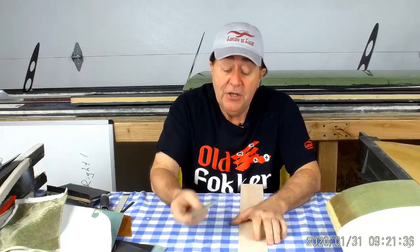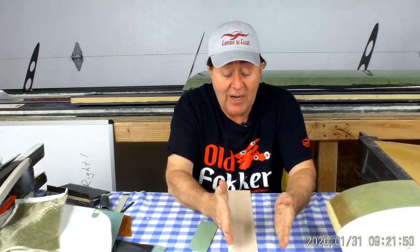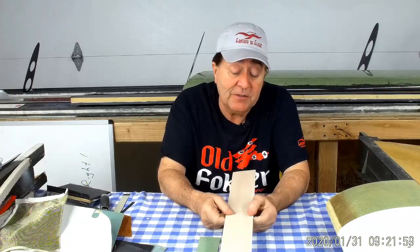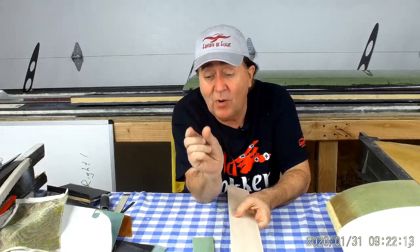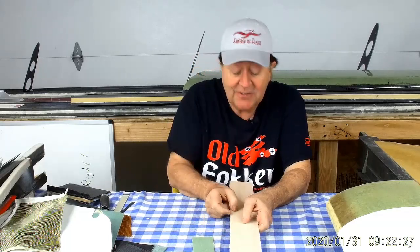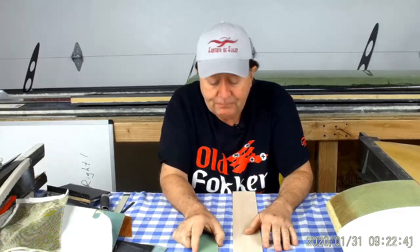So I don't have to worry about pre-gluing and getting a rough, crooked joint. I can just cut strips of balsa about an inch to an inch and a half wide — it's flexible enough to go around the mold at that point since it's fairly flat at the back. I'm building the D-tubes extra wide, so instead of having an open edge of foam, I'll have an open edge of balsa. The trim line falls somewhere in that balsa strip — could be a quarter inch, half inch, or three-quarters of an inch wide. I trim through balsa just as easily with a box cutter knife.